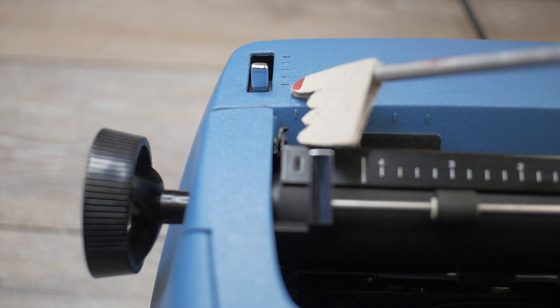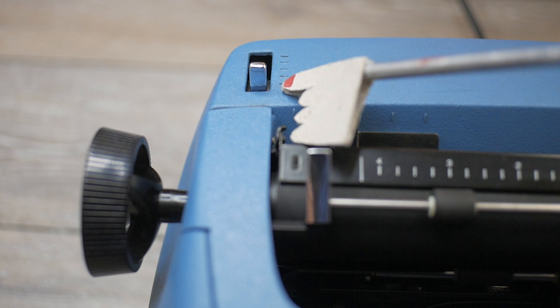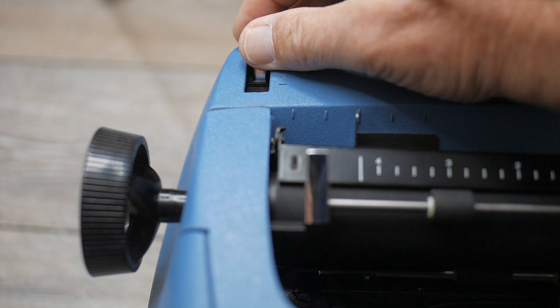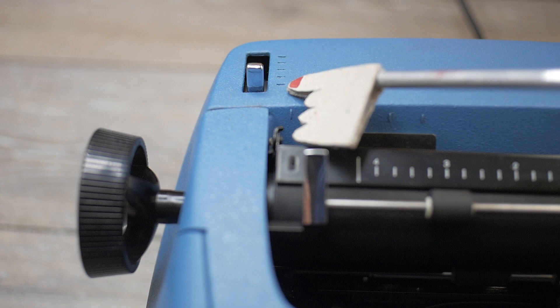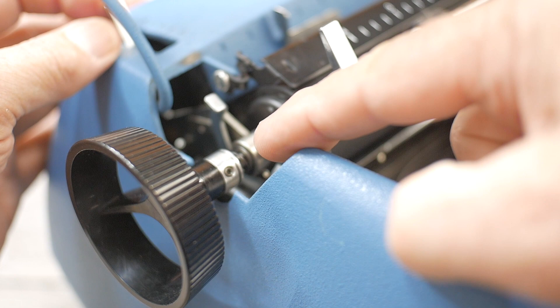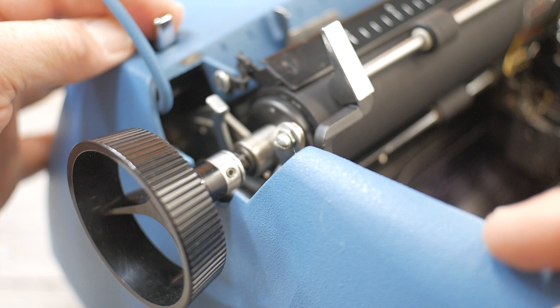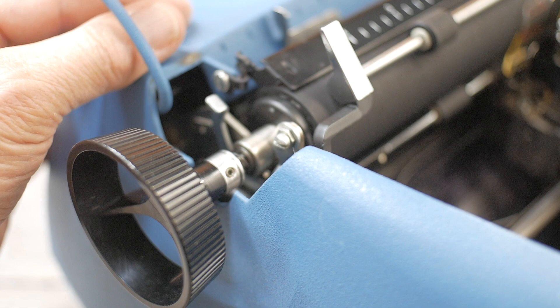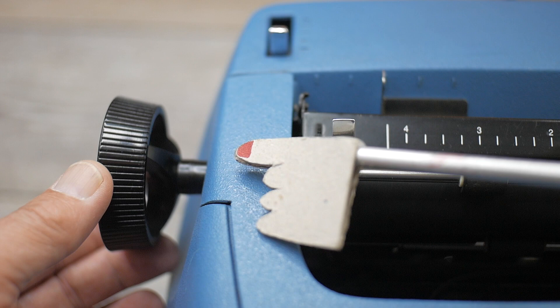Let's talk about all the features, starting in the upper left corner of the typewriter. This lever in the left rear corner is the multiple copy control lever. It makes a micro adjustment of the platen's forward to back position. In the forward position, the platen is a little bit more forward, and when you move the lever to the back it moves the platen back a little bit. This is for setting it for various thicknesses of paper — for instance, multiple carbon copies. This is really the equivalent to adjusting the anvil position on a manual typewriter.